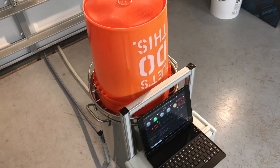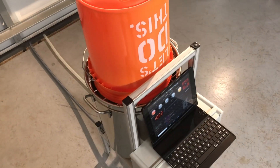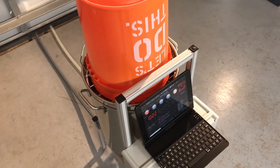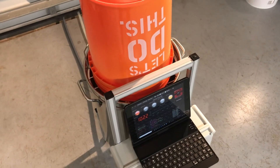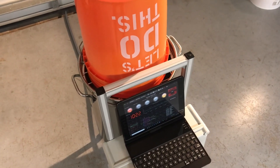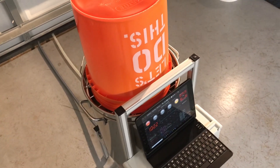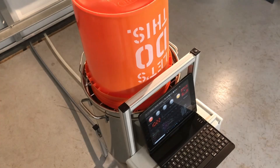After a few minutes, this rinse water will be dumped. The next step in the sequence is heating. In this step, the pot is filled, the heater is turned on, and the pump is occasionally cycled. This is done to keep the cleaning vessel wet and to ensure uniform heated water temperature throughout.